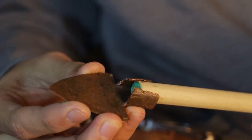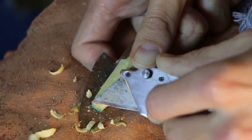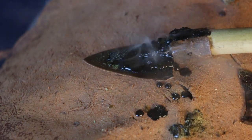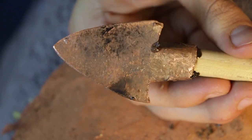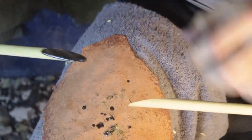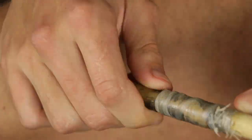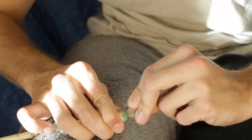I'm excited to see how it will perform and how the actual shaft will adhere to it. I got a dowel and sharpened one side of it to accept the dart point. I added pine pitch glue to smooth out the transition. I decided not to add any lashing such as sinew or gut because a lot of these points would actually probably have been hafted without a lashing of any kind — I wanted to see how my pine pitch glue would hold up without sinew. I then combined two dowels together with a slanted joint, pine pitch, and some sinew. I fletched the back end of the shaft with some goose feathers and sinew, and used a stone flake to drill out a hole in the back of the dart to accept the atlatl hook.